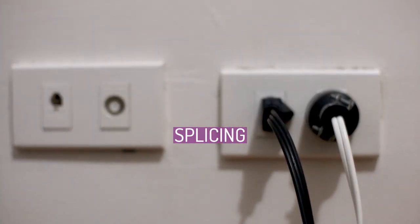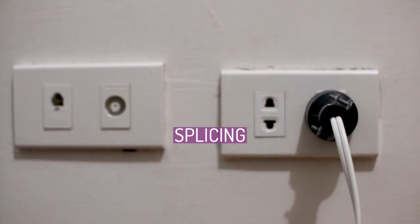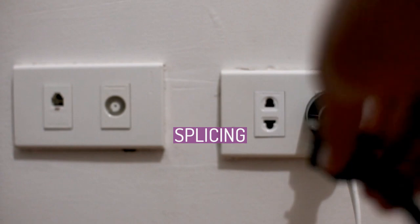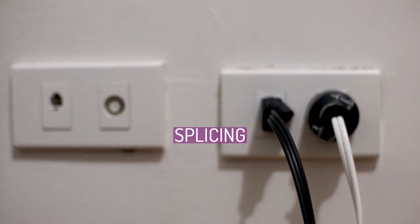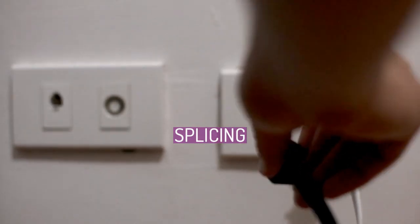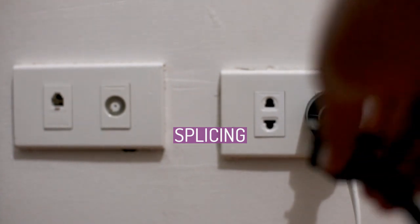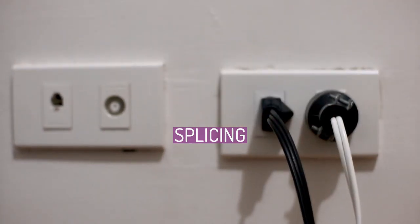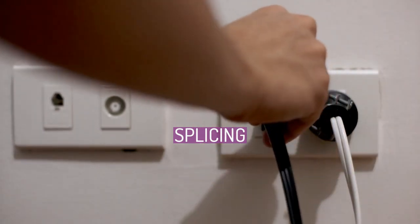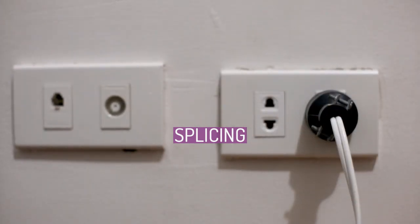This complicated process can easily result in a poor splice. Splices can also fail partially where they have higher resistance than expected, usually after some time in the field. These can be detected using thermal camera, thermal probes, and direct resistance measurements even when the line is energised. Such splices usually require replacement, either on a de-energised line by doing a temporary bypass to replace it, or by adding a larger splice over the existing splice without disconnecting.